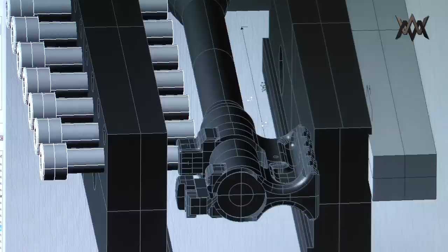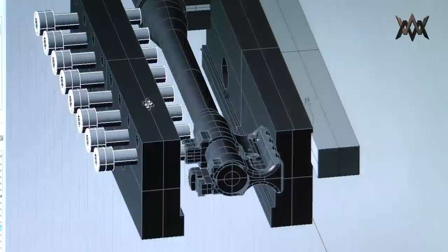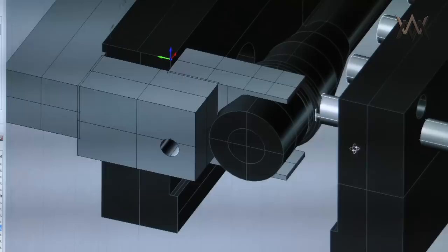The last bolt happens to line up with that sling swivel socket hole. So that'll make sure that the barrel is not canted or anything in the x-axis. And that will push the gas block securely up against the fixed vise jaw. And then this bolt can push up against the barrel extension and register that barrel up into this V-block and get that all squared away. And then this bolt here can be tightened up against the barrel, which will push the barrel hard and also push the gas port up hard into the gas block.